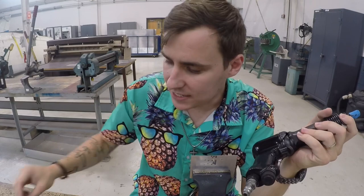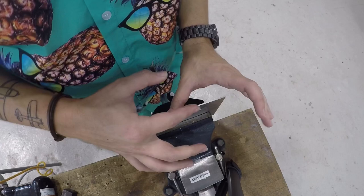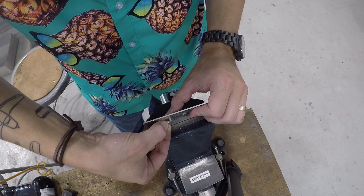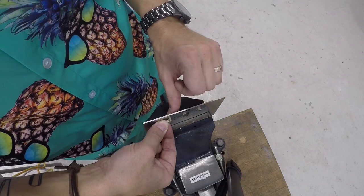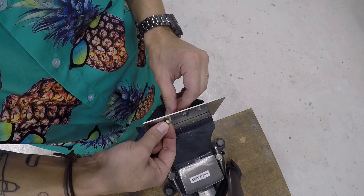One of the first things that is very important when shooting your rivet is making sure it is the right length. It doesn't matter how many pieces of metal you are riveting together — approximately one and a half times the diameter of the rivet should be sticking out the back, which would be 6/32nds. If you hold the rivet up, the entire shank protruding should equal the size of the manufactured head. I'll use a 4-4 for the demonstration, but you might grab a 4-5 or 4-6 and cut it down.